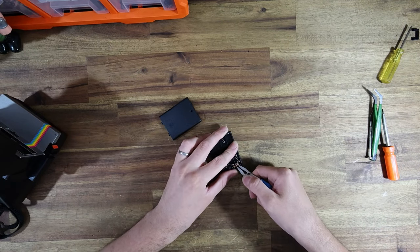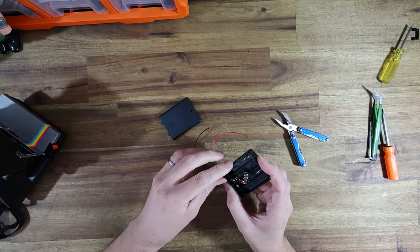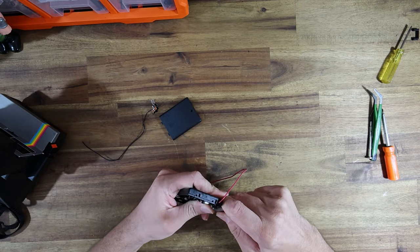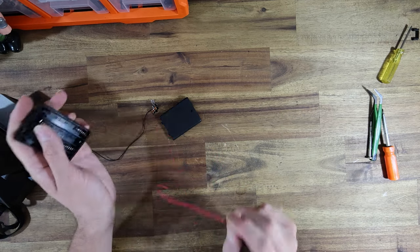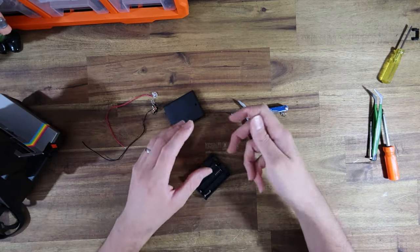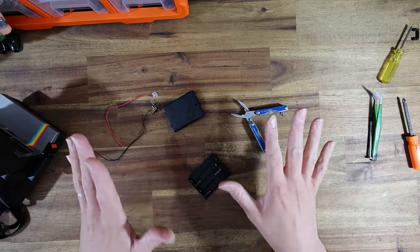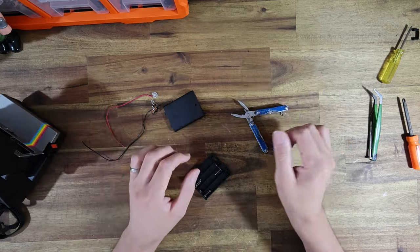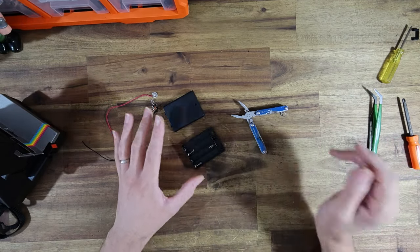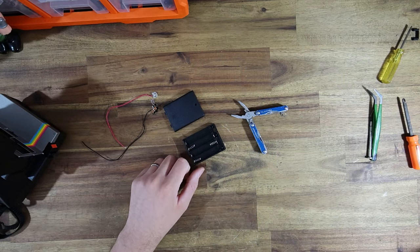The things I'm going to need for this conversion are some simple hand tools — little screwdrivers — and my soldering iron. I had someone message me about what soldering iron to buy. The key is you want one with variable temperature. Anything with variable temperature is automatically going to be better quality than one of those simple pencil-stick soldering irons that just run straight to mains power. Those things typically only have one setting — off and then like 8,000 degrees, scorching everything you try to work on. Get one with a variable iron and a tip that you can replace, as fine as possible.